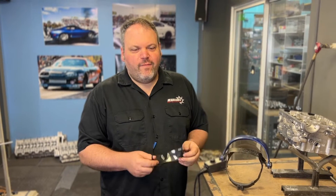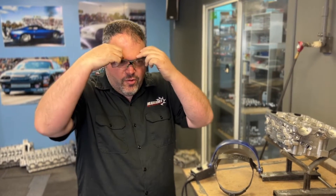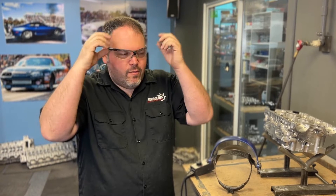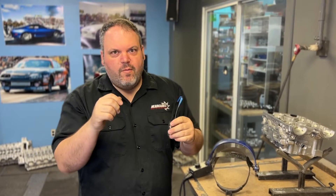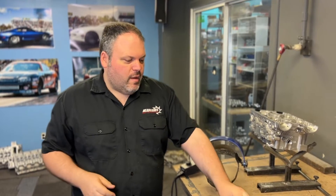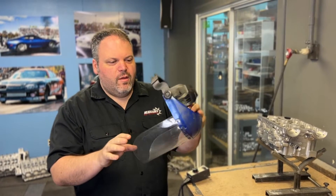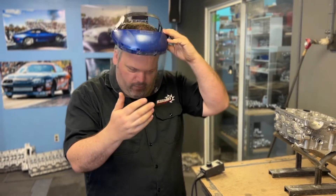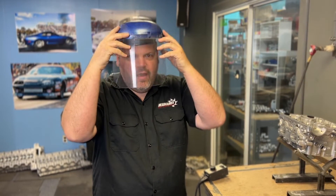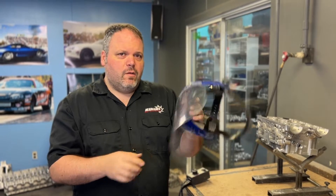Let's talk protection. I've used safety glasses before with grinding, but the issue is that when you put them on, there are still ways for metal to go underneath or below or around, especially if something's blowing at you. I've had to pick steel out of my eye with a business card using one of those. So I no longer use safety glasses. What I do — something I picked up when I worked at Pat Musi's — is a full face shield. It goes over your head so any metal will go in your hair, and you have a full face shield around your face. You're pretty much protected in every avenue.